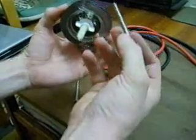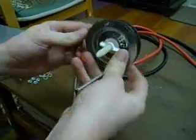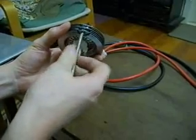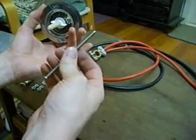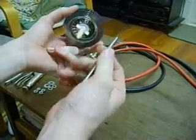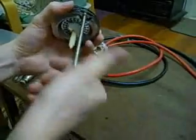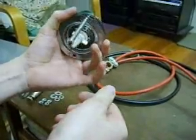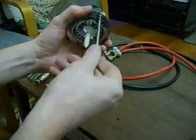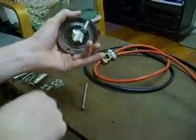So if you take our stainless steel bolt here, we can screw that straight through. Then we have to do the same on the other side — one bolt will be for the positive and one bolt for the negative. Instead of going to the expense of getting a tap and die set, I've taken one of these bolts and slightly ground it down so I could take each plate one at a time and work it through so it would just screw in. You basically want to make the hole just the tiniest bit smaller than the bolt itself. I'll probably use a pair of pliers to get that all the way through.